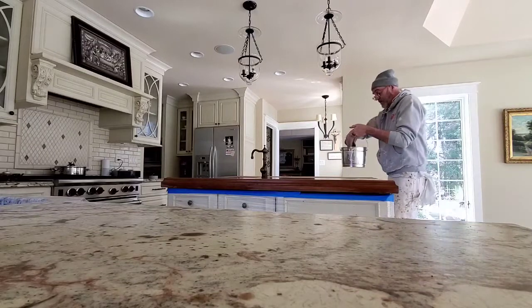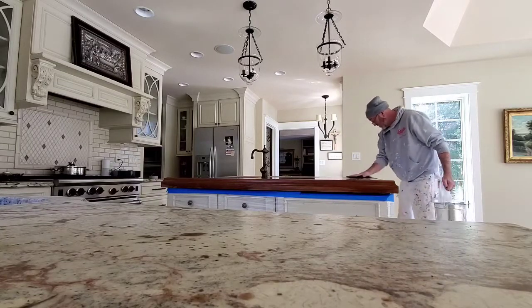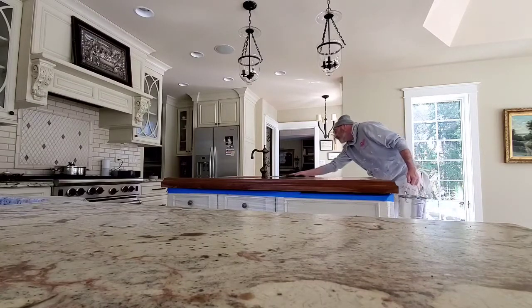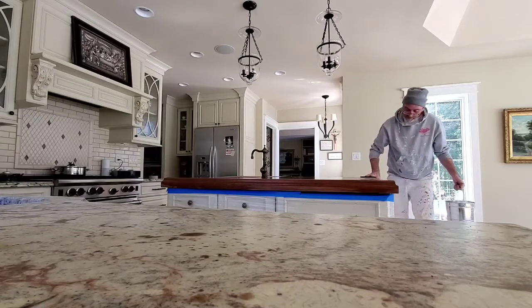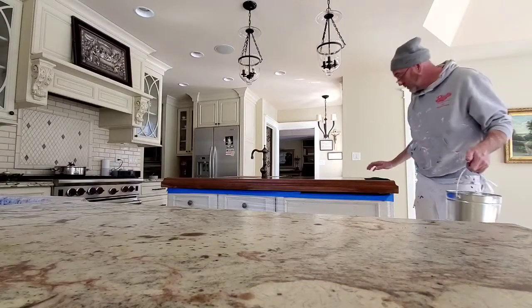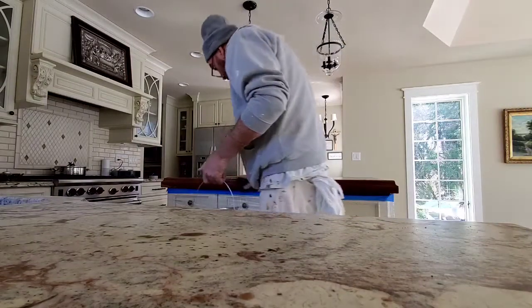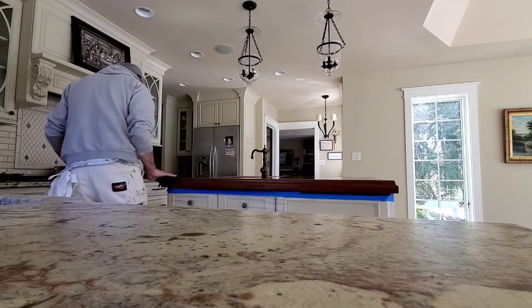So I'm gonna go over this with some dry rags and soak up any main water, and I'll show you just how orange my rags will look when I'm doing this. Already my water is murky brown. It was crystal clear, now it's crystal brown. I'm going over this, and I'm feeling just a little bit under that ledge, to make sure I don't have any material that got underneath. So when I'm wiping this down, I'm taking my finger going down to make sure I don't have anything there that I shouldn't. I don't want any surprises when I go to stain this. And looking at it wet, you get an idea of what it would look like after I stain it. That's gonna look awesome. Well, color wise, you get an idea.